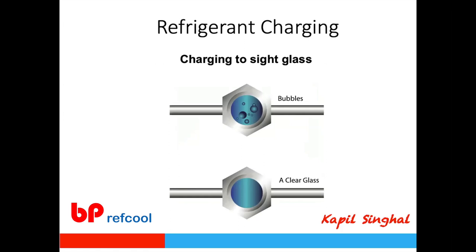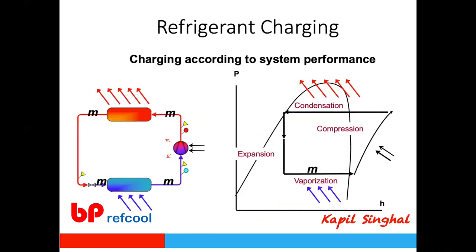One traditional method for top-up charging is checking the sight glass on the liquid line — bubbles indicate undercharge, and as they disappear the system is critically charged. For older systems this worked, but with today's more complex systems it's not fully reliable. Only use the sight glass method if the OEM recommends it; otherwise use other methods that are more appropriate.